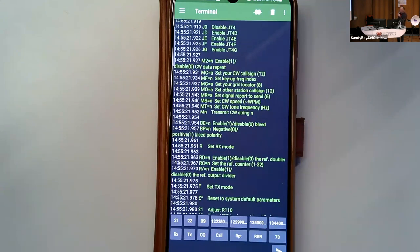And on my tablet, I've just got all the charge pump current settings from 1.2 milliamps through to 4 milliamps. This really helped us in the initial stage to look at the analyzer and watch things push out, measure the power, and see what's actually happening. Once you can see that over three or four settings the power isn't changing on the main carrier, you know you've cleaned the noise up and that's all you need to do. But there are other things you can set in here.